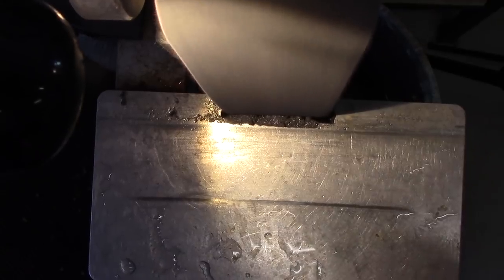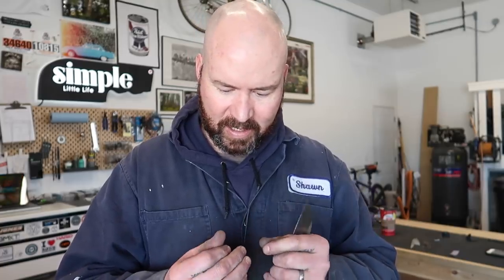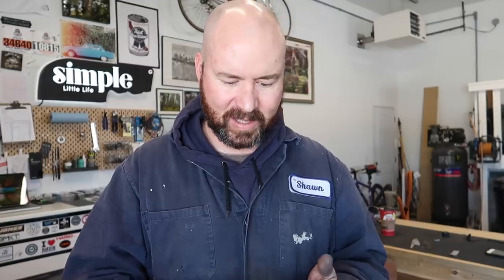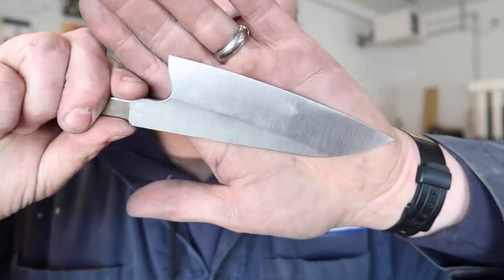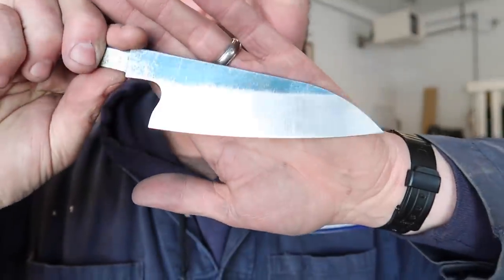That was the day for me. I did a lot of grinding yesterday and my fingers are just beat up like crazy. So I thought, I might as well make a little jig. I kind of took an existing jig I had, modified it so I had a little stop right here - basically just tapped some holes - and that way I could hold the angle consistently. I'm not lying to you, I'm not telling you this was all freehand ground. I can't freehand grind quite like that on this radius platen anyways - it's a little trickier than a contact wheel. Usually when I'm doing things on my 10 inch contact wheel I'm always freehand grinding. I've gotten really good at it, but I'm still learning with that radius platen. So I opted for a jig, and it works great.